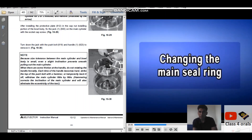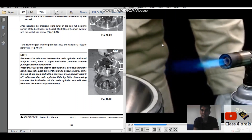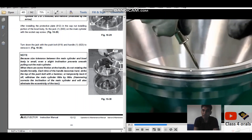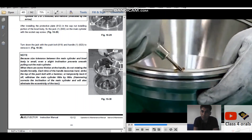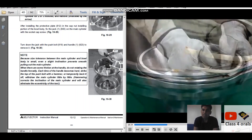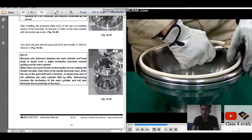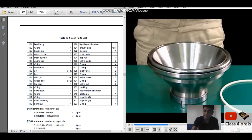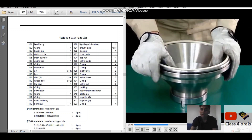While boxing back, the procedure is reversed. Now we have to change the main seal ring — this part is very important. The Mitsubishi purifier provides us the main seal ring removal screw. We have to heat it with the flame and then open it firmly. The main seal ring is a very integral part of the purifier — be careful, do not make any burn marks. Now we have to clean the main seal ring groove because dirt can cause the valves to leak. Clean up the main seal ring groove, then fit a fresh main seal ring.